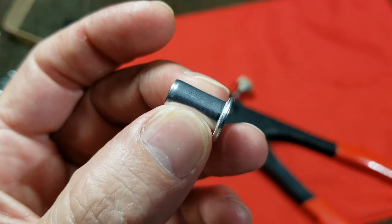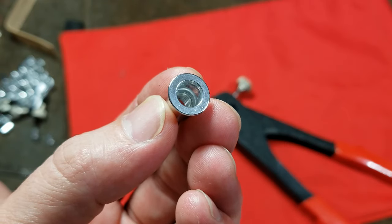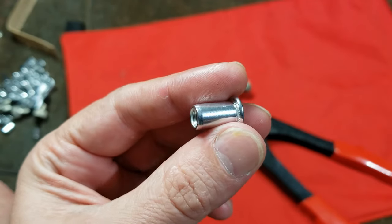These are various different size little threaded inserts. These are aluminum, but they also make them out of brass. There are also some really heavy-duty industrial ones which are steel, but they require a hydraulically-powered tool and are several hundred dollars.